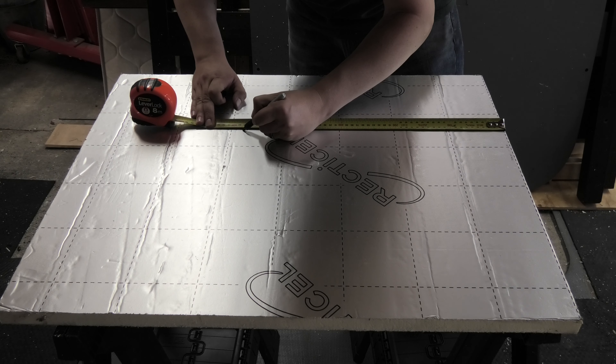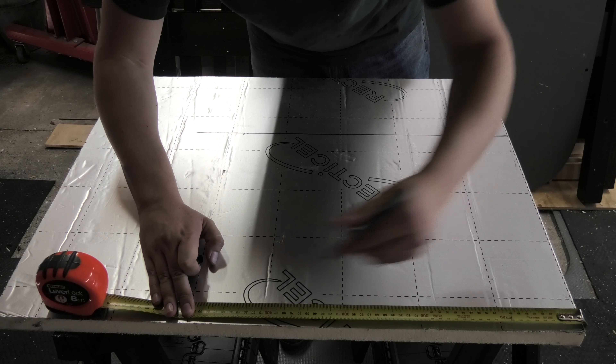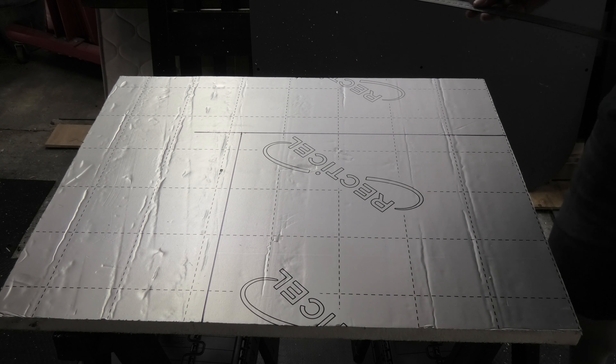The product we're using to mount the PIR board is called a stick pin. It's a small metal spike that's quite soft so you can fold it over. It's got an adhesive backing on the plate and then there's a little clip that slides down — it's barbed, so once you put it on it's going to stay on. That's how we're going to mount the PIR board today.